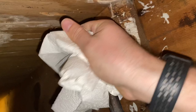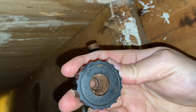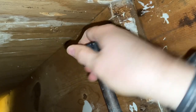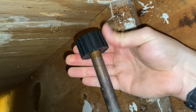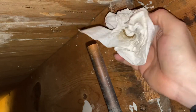I'm just going to take a paper towel and try to wipe off any dirt that's on here. Then you use this half inch pipe cleaner — just give it a spin. Make sure you're all the way down, keep rotating it and kind of work it up. You can see how shiny it is on top — that means it's clean. Wipe it off; you usually get a little bit of dirt that comes off with it.